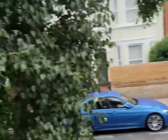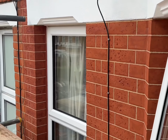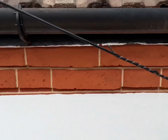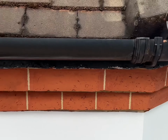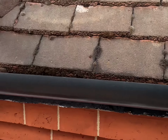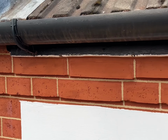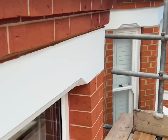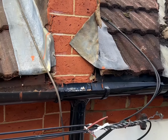What we're going to be doing now, my roofer is away on holiday this week, but next week he's down to come out and have a little look, and we're looking at changing this guttering and this fascia board. Guttering is leaking in a few places on a few of the joins, so we'll put a deeper gutter, 6-inch deep flow gutter on that, and then change the fascia there. So we'll go for a black UPVC, maintenance free for the customer, that's what she wants. All the parapet's all been done as well.